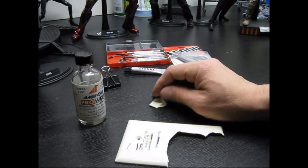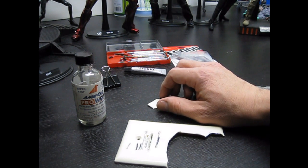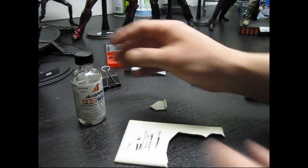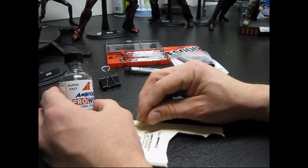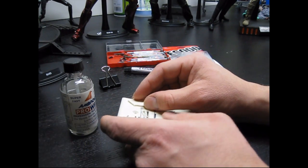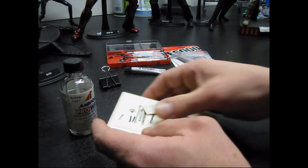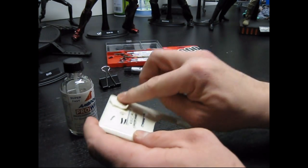I mentioned capillary action before. Remember, we were talking about using the hot glue gun on those buttons for fabric. Here we're going to use capillary action to our advantage. What this does is basically melt down plastic and allow it to bond to other plastic. So you can take two pieces of plastic. I've got a light switch cover here that I chopped up with my snips. This plastic and this plastic are the same plastic. I cut this piece off of this. So I'm going to bond them together.